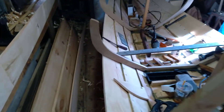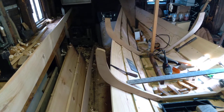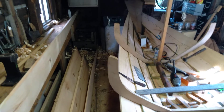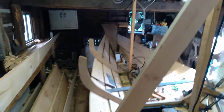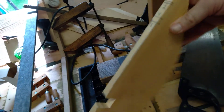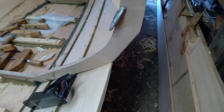It's just very interesting — it's definitely a transition. The first plank above the garboard is being tucked in; you can see it at this angle — being tucked in by the transom and pushed out by that frame. Then by the time we reach the next plank up, the number two plank, the curvature of the boat is bowing the top edge of that plank out beyond the plane of the face of the frame. Anyway, those are the sorts of things you end up thinking about when you're building a Dory. So what I did was I made up a quick little jig for marking the bevels, because that's what we want to be doing today — marking these bevels.